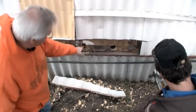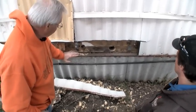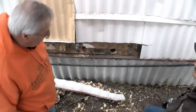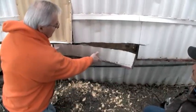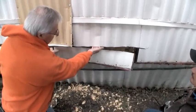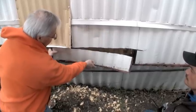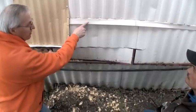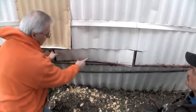At this point we would normally go ahead and insulate our cavity with our fiberglass. When we're done, the way we would seal this access point up is we'd take this piece, put it back, and put a Z-channel underneath here — it comes from underneath, over, and covers up the piece we're putting back. And when we're done it should look very similar to this right here. Much easier way than drilling through the siding.